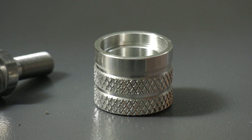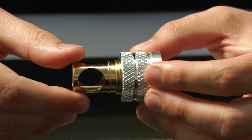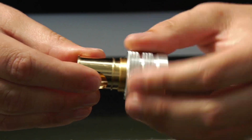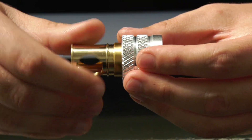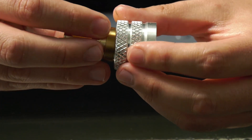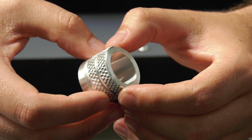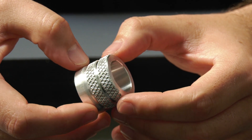And then what about the aluminium part? Again, quite a big part with a lot of material removal. That's the mating part to the bronze part — both very fine threads that have to be a nice fit to each other. What's the actual thread? M20 by 0.5, I think. So really fine thread, really accurate. Yes.